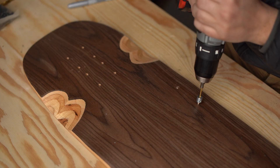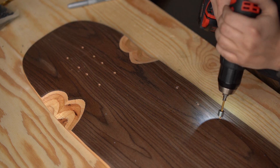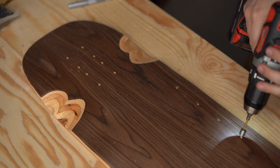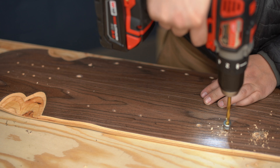Once you finish marking your deck, we can start drilling holes for our wood inserts. Before jumping all the way to a drill bit that accommodates the full width of the wood insert, start off with a slightly thinner drill bit to create a pilot hole. That way the thicker drill bit doesn't start wandering and scratch your deck — I've had that happen a couple times and it's really sad to scratch a beautiful brand new deck with a drill bit.